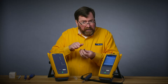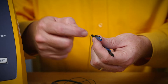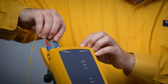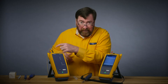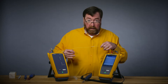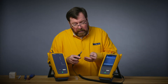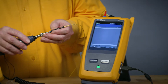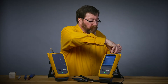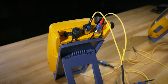Now we're used to LC connectors that have a horizontal orientation, but these MDC connectors have a vertical orientation. So I'm looking to see where this key is along the top edge, and I need the key to be on the right-hand side, because what I'm going to do is line up one of the legs with the photo detector inside. So there is one leg lined up. Take off our dust cap — just because it has a dust cap doesn't mean it's clean. Use a finger to line this up and slide that on. With the black key facing to the right-hand side of the tester, that will line up the fiber. We get the happy noise.